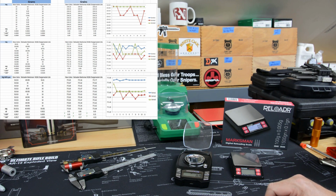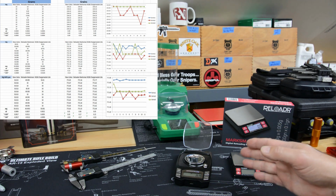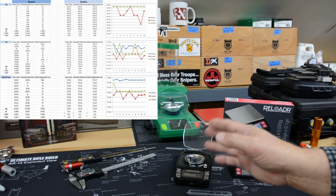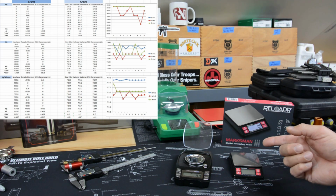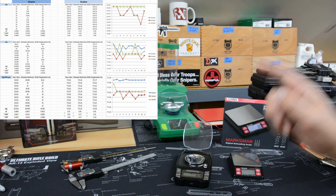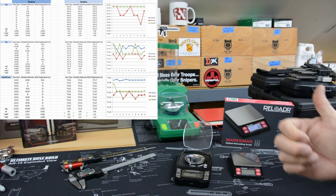That's a lot. I mean, we're trying to keep our charge separations typically 0.2 or 0.3 apart when we're doing load studies, where you might do 25 grains and you go 25.2 or 25 grains to 25.3. Well, its error is more than the range that we're looking at by a long shot on the lower charge weights. But the new Calox scale and the RCBS Chargemaster Lite, perfect.